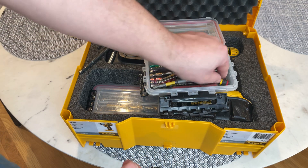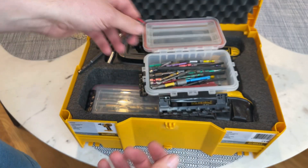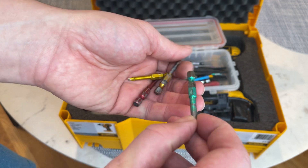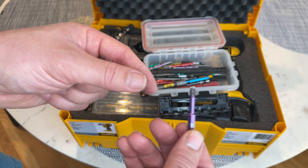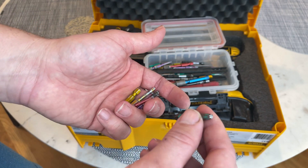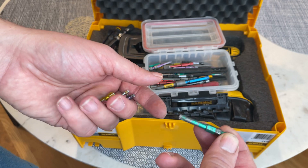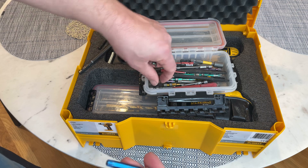More extensions. This little guy flips around — it's made by Malco and is really helpful when you're doing sheet metal work because these are the bits used in sheet metal all the time. Then I have a ton of these from GRK: T10, T15, T20, T25, T30 Torx bits. I almost never use Phillips or slotted screws anymore — I'm always using these star bits. They're color-coordinated so when you get a box of GRK screws that's green, you grab the green bit.